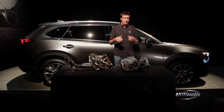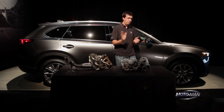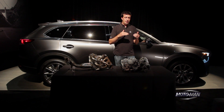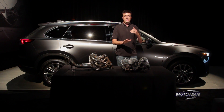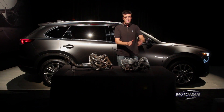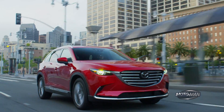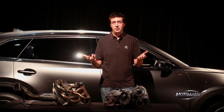We realized that if you're looking for an engine that is responsive and direct when you accelerate on the freeway — say you get stuck behind a truck and want to pull around them — if you roll into the throttle with a high horsepower engine that doesn't make a lot of torque, you can't make enough torque in sixth gear. It downshifts, doesn't quite do enough in fifth gear, downshifts again, and while you're waiting for all these downshifts you keep pushing the gas pedal harder. It finally gets to fourth gear, rockets away, you overshoot, and you end up in this cycle where you're asking for more, it finally delivers and overshoots, you back off, and you end up driving poorly. The car doesn't do what you want — it's a pretty unsatisfying experience, but that's what we're used to.